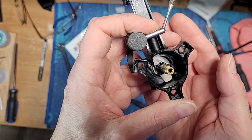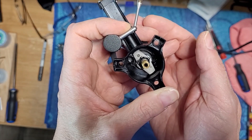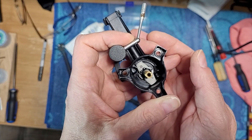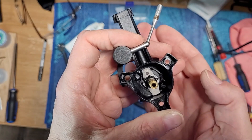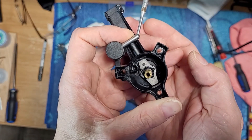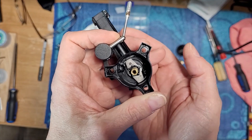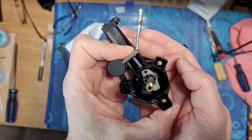I have put the five little ball bearings in their respective spots. They will not stay in those spots on their own — you can't press fit them in. What I've done is put a little dab of synthetic grease on each pad where they're supposed to go, and that's holding the ball bearings in place. I couldn't even pick them up with a magnetic screwdriver because they're stainless steel — they won't stick to a magnet. So they are in their five positions in a pentagon shape.